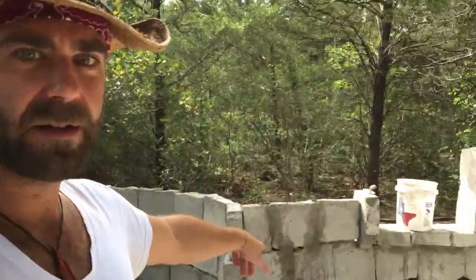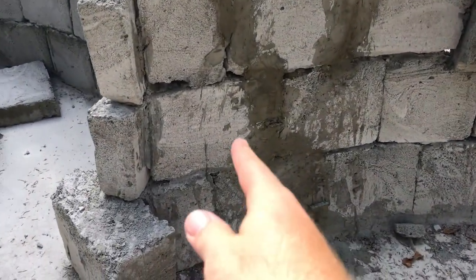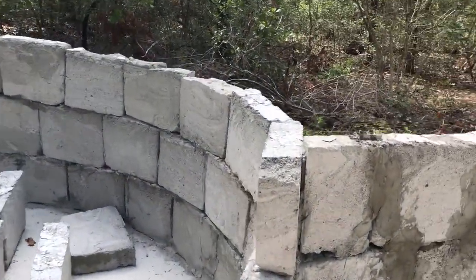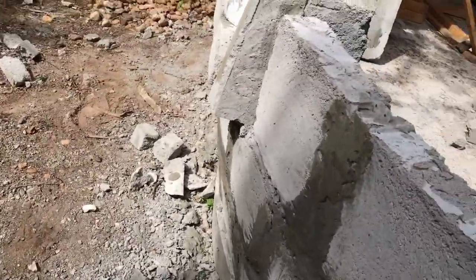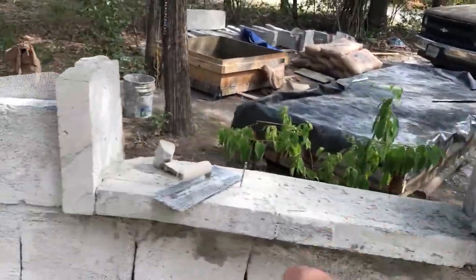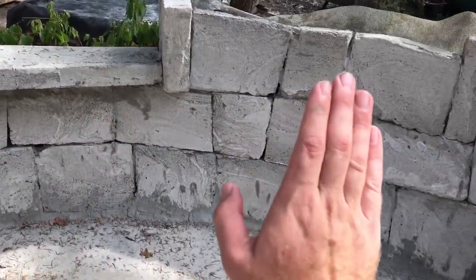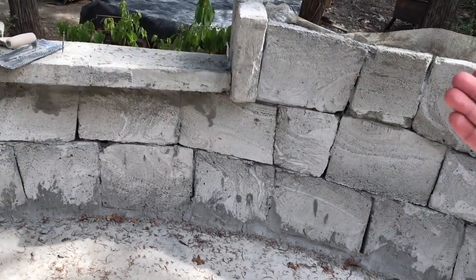So when I came back, there were two cracks — well, one crack in the foundation, a hairline crack, and then these bricks started going up. Like I said, I probably should have gone ahead and wrapped them because these dry out and they're going to move a little bit. It's better if you go ahead and solidify them. So today I'm about to make some mortar and fill all these cracks. I'm going to rasp it first, then try to push all the mortar in there, because I didn't put the mortar on before I put the mesh.